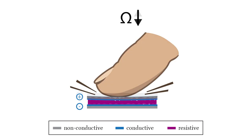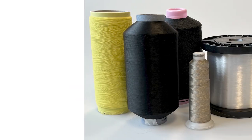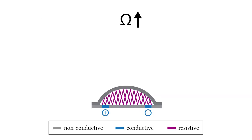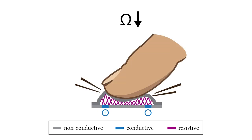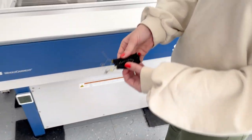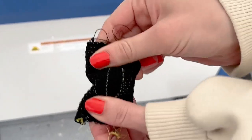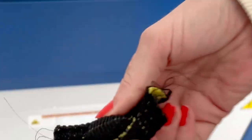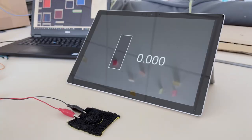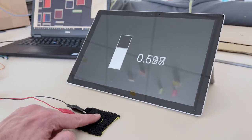Analogous to a printed FSR sensor, we combine several materials like conductive and resistive yarns. We utilize the so-called interface effect by adding resistive yarn to the nylon filler. The electrical resistance drops whenever the filler is compressed. Our sensor is created in a single manufacturing step using a regular industrial-grade two-bed weft knitting machine and does not require any post-processing to be operational. The result is highly sensitive to pressure and has a comfortable haptic appeal.